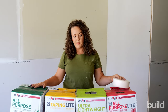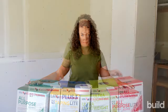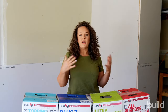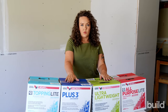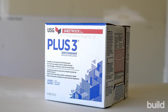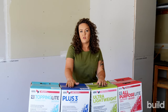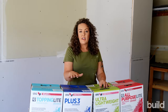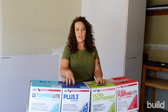These are the only ones that we should be taping with, using either paper tape or FiberFuse. Now we're on to our finishing, topping, and coating muds. We added in Plus 3 — it's my favorite to coat with. It always turns out really nice. They say you can do all of the finishing steps with it, but I don't tape with it. So this is only a coating mud for us. We do screws, flats, butts, angles, and corner beads. After all the tape's on, this is what we're covering the tape and then coating with.